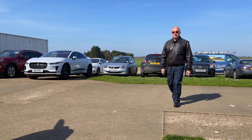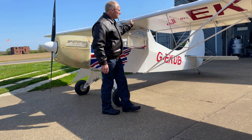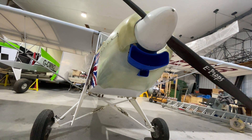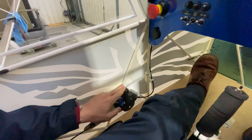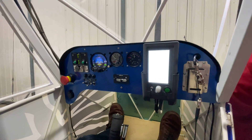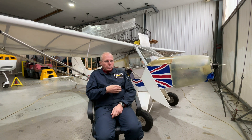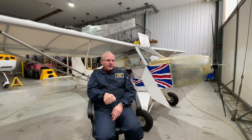Compared to a normal engine, flying this is different in a few key ways. With a normal engine I've got fuel controls, mixture controls, and carburettor icing to worry about — none of that is an issue on the electric powertrain. In the early days of testing we did worry a lot about cooling, but that's now solved. If you look at the nose you can see a really big air intake, and that's all for cooling the motor. So it's now very much carefree handling — more power, less power, occasional glance to make sure temperatures are fine. The significant new consideration is that if you close the throttle completely on this electric powertrain, the propeller stops — there's no power into the motors whatsoever — and to get it going again needs a trickle of power for a few seconds.